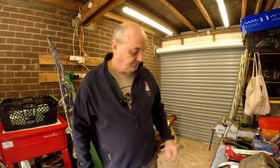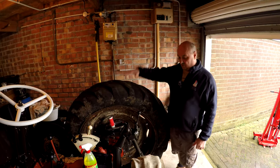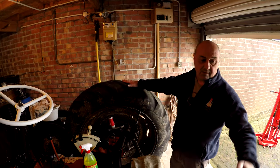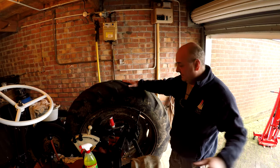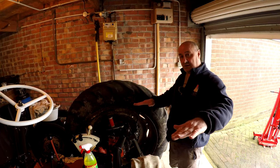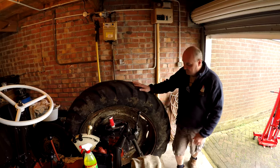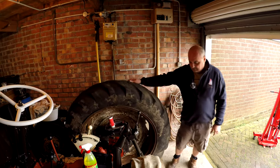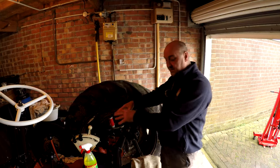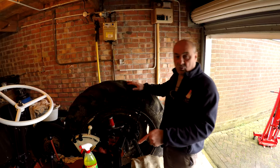Let's nip next door and have a look. This tyre is different to that tyre — this one's got a dome top and isn't as big in diameter as that one, which has got a flat top and is probably two or three inches bigger in diameter. So consequently the tractor leans over. I've jacked it up under here and as you can see we've got the wheels off the ground. The whole purpose of that is to get this leg of the axle to drain back into the centre and out — we've got the drain plug out underneath.